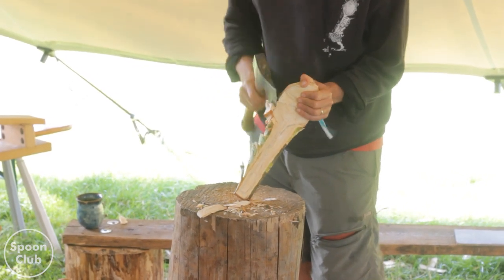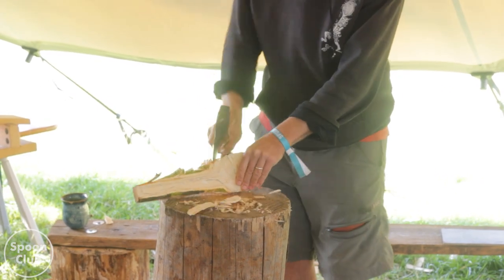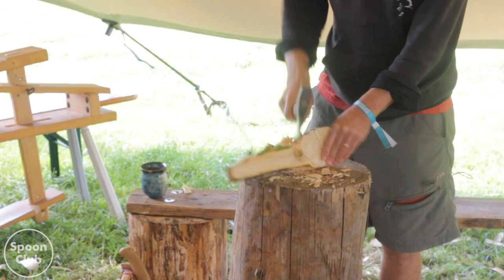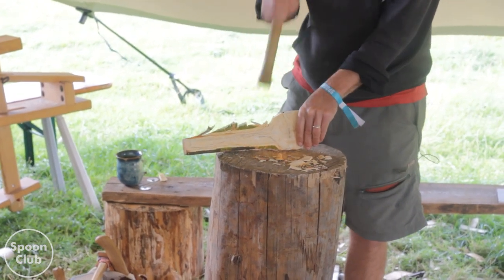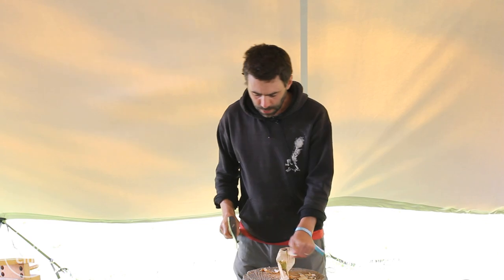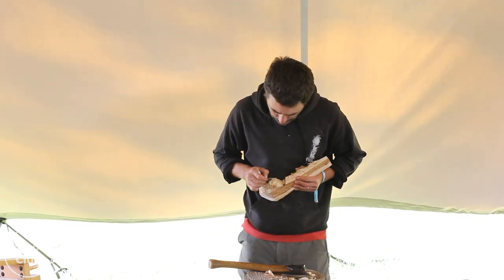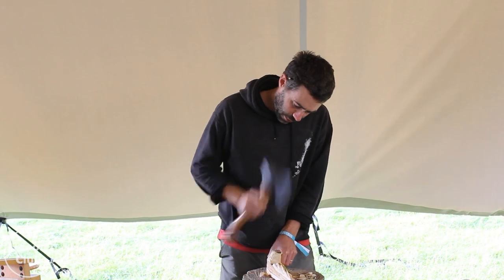This is the interesting bit around this knot. I think there's going to be knot in the bowl at this rate and if I take it all out we lose the spoon. A lot of people will cut a saw cut in but it's slow and boring so I don't do it, and I always over-cut when I've done it. If the bowl is down here there's a kind of triangle there that's not going to be in the spoon anyway - you're going to have a keel underneath the bowl - so you can get loads of that off with the axe.